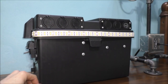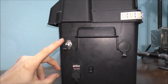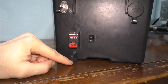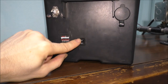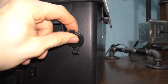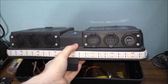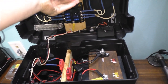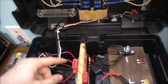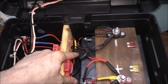This is the big battery box. You can get a small one if you choose. I have a LED strip plate on the front of the box, a master switch to turn everything on on the top, a charging port to physically charge the battery and an on/off switch, and a DC 12-volt cigarette outlet to power anything off that side as well. Let's pop open the lid. It looks really clean and organized. We have a 30-amp master fuse for the circuits on top, a 20-amp fuse for the cigarette outlet, and a 10-amp fuse charging circuit for the battery.